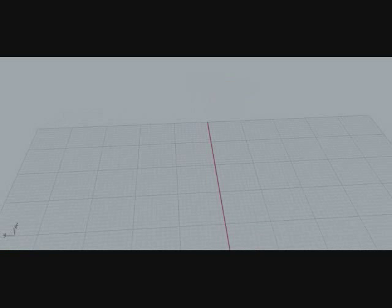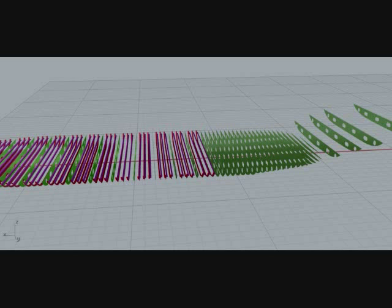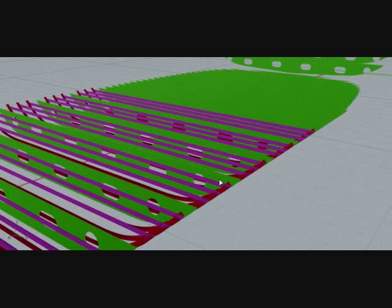First, the solid floors. The solid floors are provided in every web frame and every frame in the engine room and pounding region. This is the bottom frame, which is provided in every ordinary frame. This blue one is a strut. The strut connects the inner bottom and outer bottom.